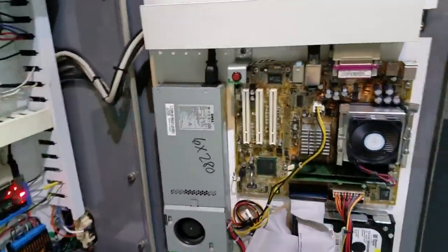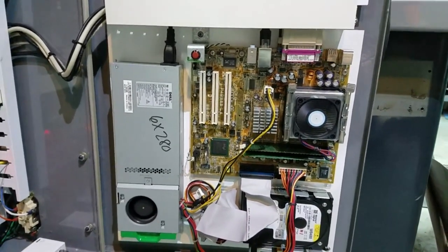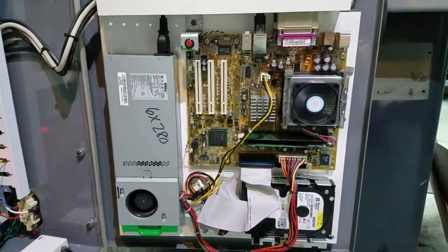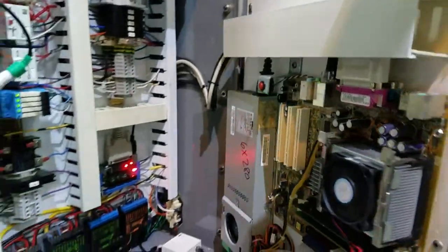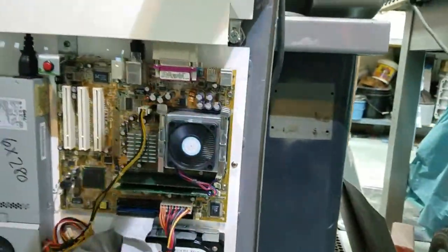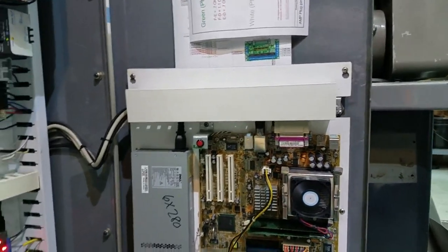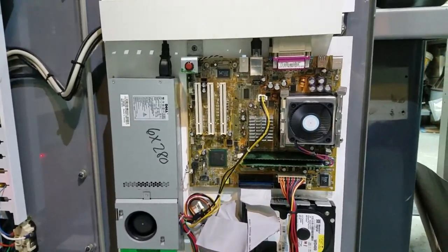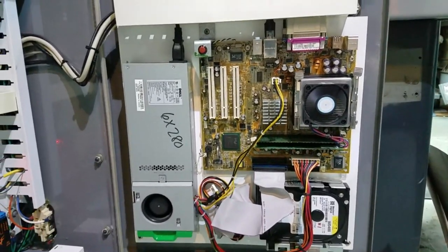The final piece is really just a standard PC — an old, crummy, dumpster-grade Pentium 4 computer that I have mounted on a plate on the door of the system. All the cables just travel from the door right into the main enclosure. LinuxCNC does not need a high-power computer to run it; this computer is from probably 12 or 14 years ago, and it's certainly adequate for what I do.